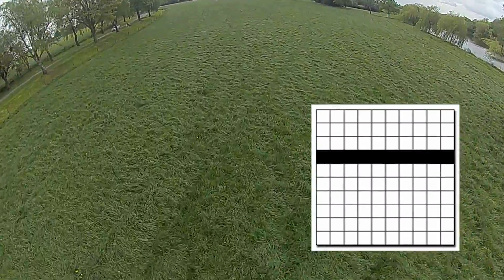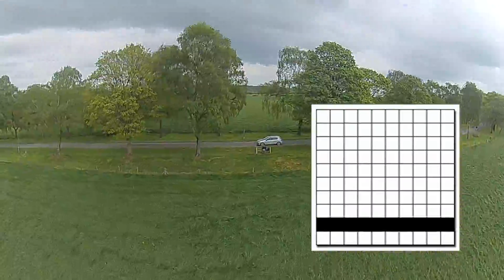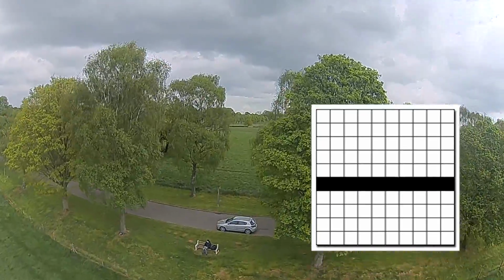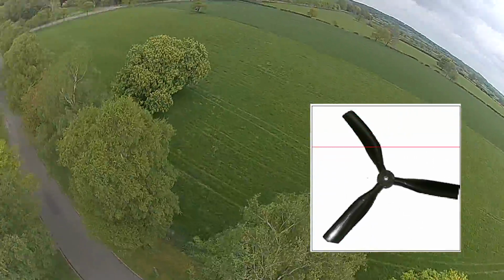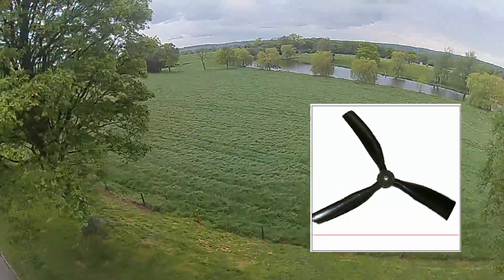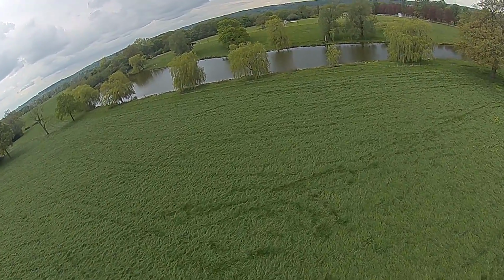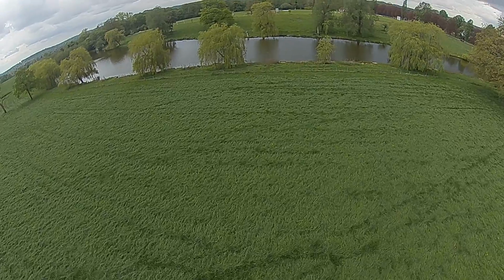So if by the time the scan is over something has moved in the picture, or in our case the camera has vibrated, then the sensor captures a slightly skewed image, which we see in the form of Jello. So essentially CCD and CMOS use two different methods to digitally open and close the shutter.